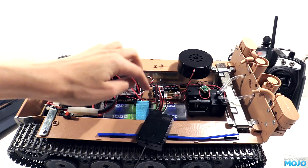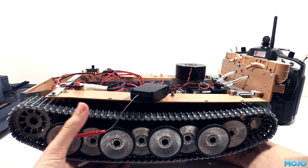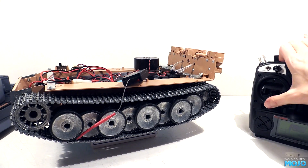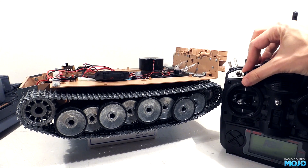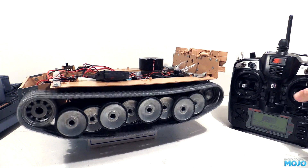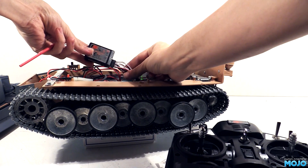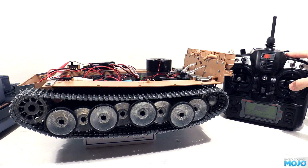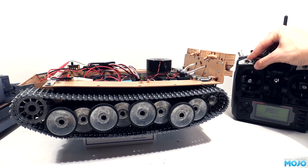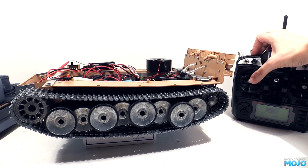It's all roughly installed now. Before we do the final bits, I'm going to test it just in case something isn't right — I've got it up on a box just in case it has a go at escaping. I modified the program a little bit for some added safety: when you turn on the tank there's a green LED that blinks rapidly until all the controls are in the centre, just a little arming procedure. The engine start needs channel 5 to go from centre to its minimum. With the engine running, the right stick should control the throttles — or not, that's the main gun. Forward and reverse is on the left stick. Looks like we need to rearrange the channels a bit, which is just a case of swapping the connectors around. Forward and reverse, left and right, machine gun by turning the knob all the way up, turret rotation, elevation, and the main gun. That's the basic set, all working.